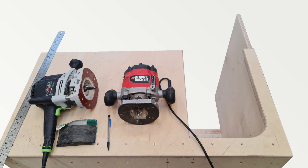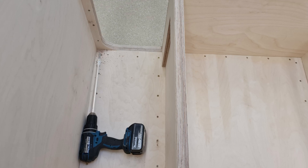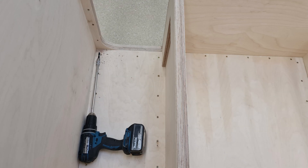Appropriate edges were rounded and then fitted top and bottom prior to some final shaping. There is not much room for screwing from inside at the front right corner — one of these 12-inch chuck extensions from Irwin or the like is a useful get-out-of-jail card here. I cut some 12 millimetre ply for the floors and fitted them, screwing them down onto the CLS frame.